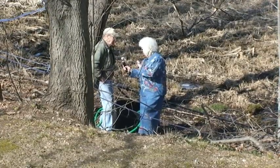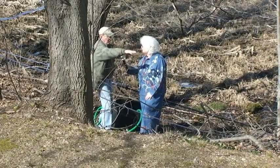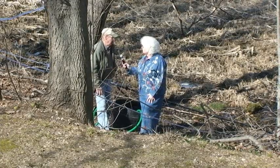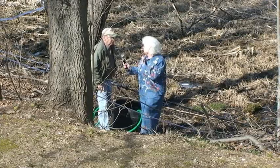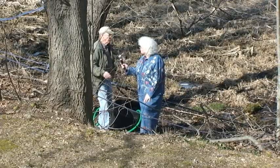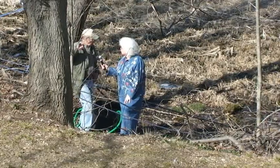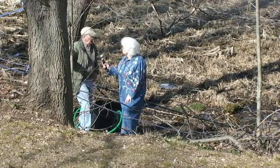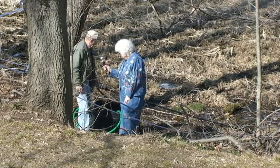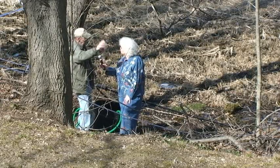Now the lines that you're referring to, because I know we've got the black ones. Basically, mostly the main line, but even a lot of these laterals were under snow also. But they can stay up all year round? Oh yeah. When I get all done, I start pulling the taps out and I fill my tanks with water and I reverse everything. Everything runs just the opposite. I plug my hose into the end of the main line and I just flush everything out with water.